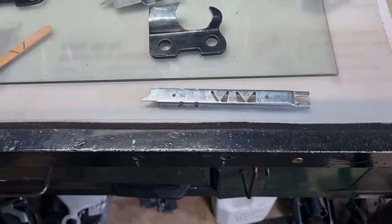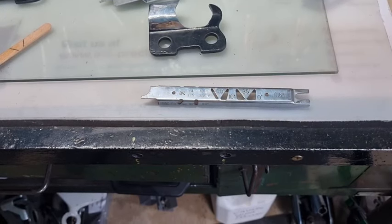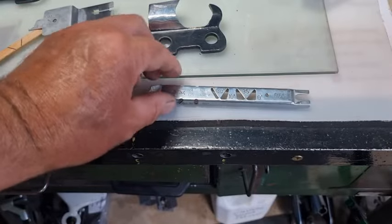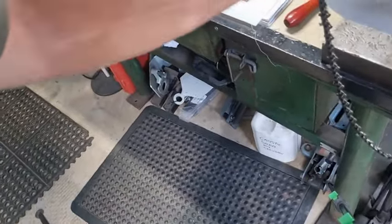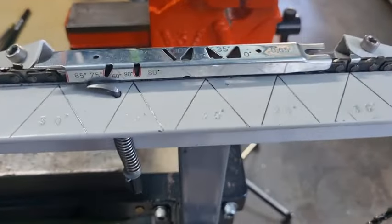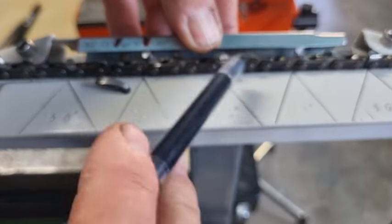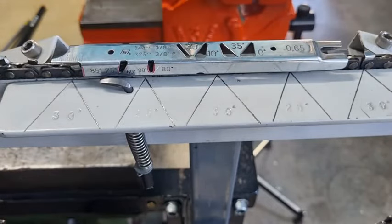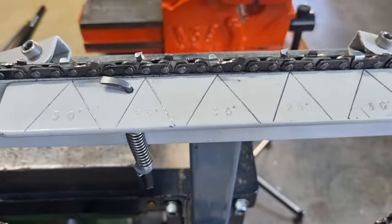The other problem I have with these gauges is that while they work okay when the chain is about half worn, when it gets worn down beyond that I only ever use a progressive depth gauge. When this flat gauge is placed over the chain, it sits on four teeth — one, two, three, four. If those teeth aren't perfectly level then the gauge won't sit perfectly level, and the raker won't protrude as accurately as it should. It's pretty good on a brand new chain but it can deteriorate, giving you an incorrect reading.